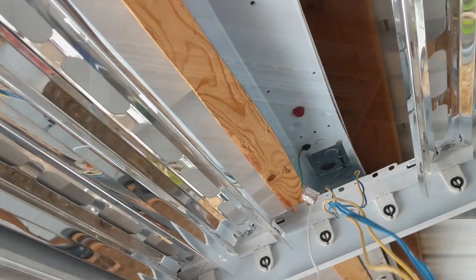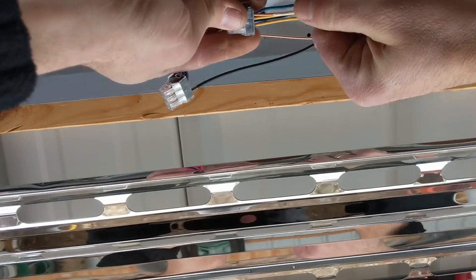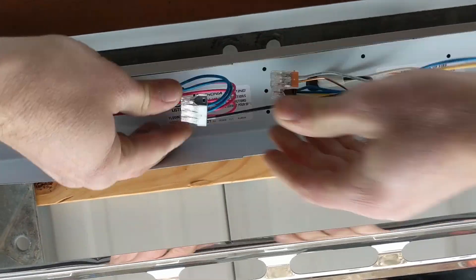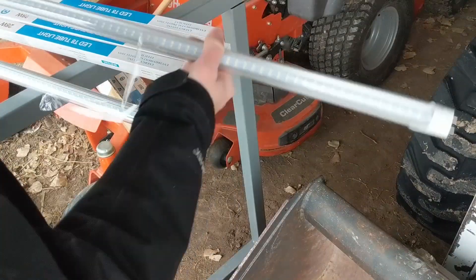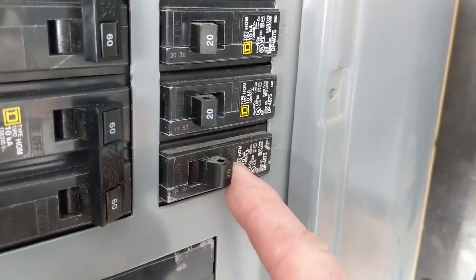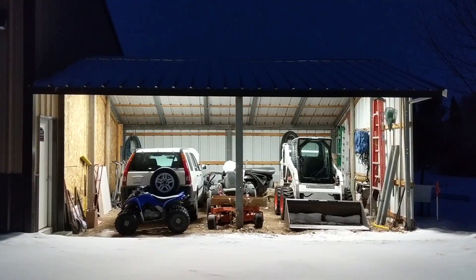Turn off the power, mount the lights, then take all the wires from one end and connect to one of the source power wires, and the wires from the other end to the neutral wire, and ground to ground. It doesn't matter which wire goes to which as long as the wires on one end go to either black or white and the wires on the other end go to the opposite one. Pulling out the new bulbs — these are dual-end LED bulbs. For this style of wiring conversion you have to use dual-end LED bulbs, so the power isn't on just one side; the power and ground are on both ends. Turn the power back on, check it out — works great. I'm really happy with how it turned out and hope you can make some use out of some old fixtures yourself. Appreciate you watching, hope you like and subscribe.